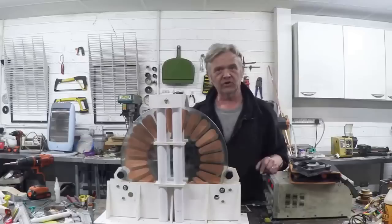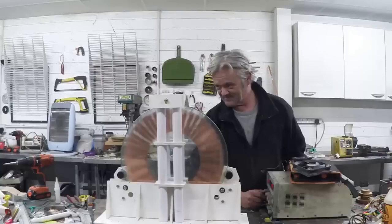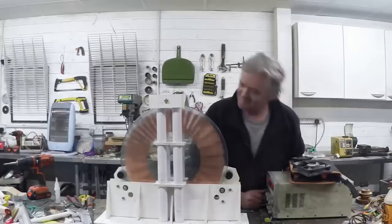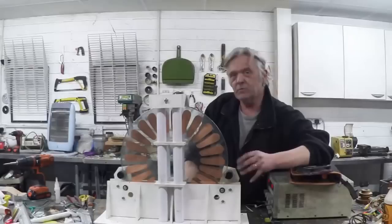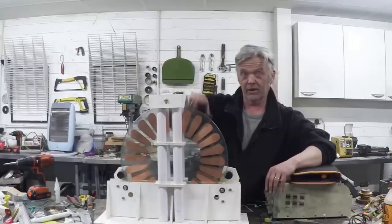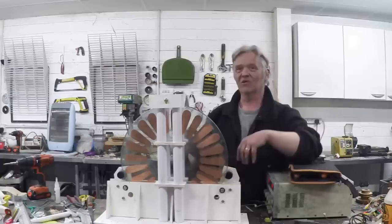Let's give it a bit of voltage and see that thing spin up. That's awesome — it really is! We've used a couple of large bits of glass without being sure where the centres were, so doing it this way — resting in the cradle — works really well. The top section, made from 36mm waste pipe, keeps everything close together and in true without needing a central axle. I'll continue with this — but there's the heart of the unusual Wimshurst machine.